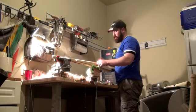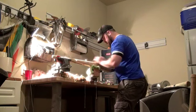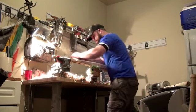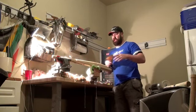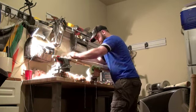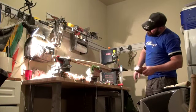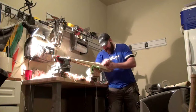But this one we're going to have to go a little deeper, which we'll use a round bottom plane, because I'm going to try and take a little of this bulk out just to get the weight down. Just working in about 15mm from the edge, because I can map that by eye, but just by putting this tiny little channel in, we're going to be stripping out a couple of ounces as we go, not just from the cuts, but by the time it's levelled off and sanded, there's quite an amount across the whole of the cleft.